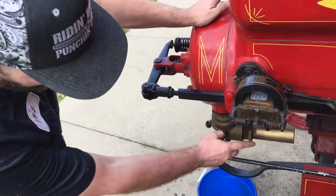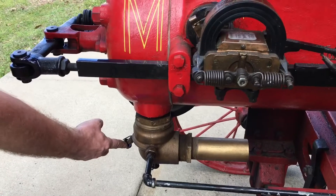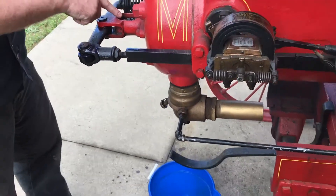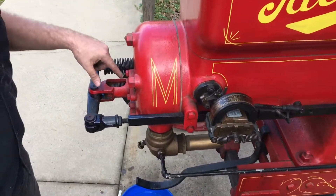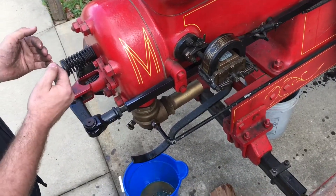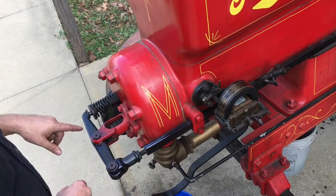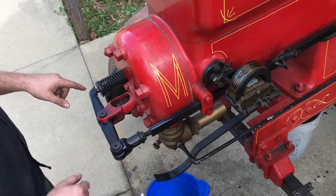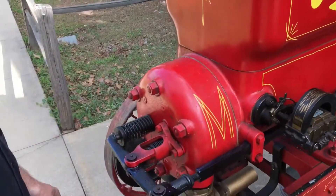Your intake is down here — this is where our fuel comes in. Instead of having a carburetor, you just adjust your fuel. Your intake comes up here with this valve right here. Something else different about these hit-and-miss motors: this intake valve moves in based on suction — there's no rocker arm doing it, just a very weak spring to actuate it. Over here is our exhaust valve. This bar will actually move in — you'll see this rocker arm come way out. That opened our exhaust valve. That's how the hit-and-miss motor works.